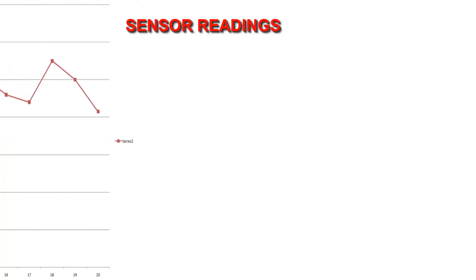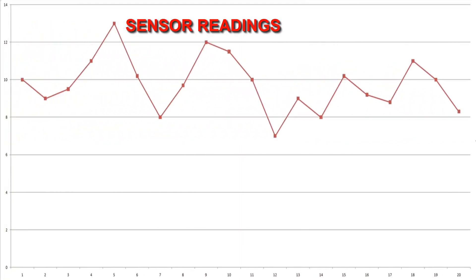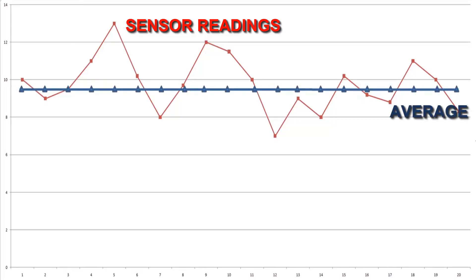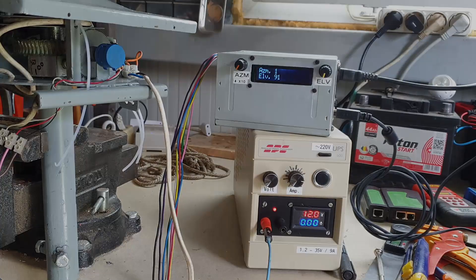As a solution, I averaged the last 20 readings of the azimuth position, smoothing the reading. I also added a dead spot of one degree left or right of the current position to stop the motor from continually adjusting. The shaking and continuous start-stopping of the motor has stopped, and I got a smooth, silent ride.